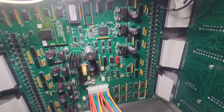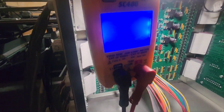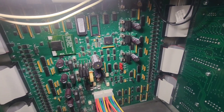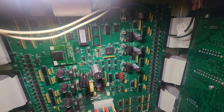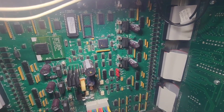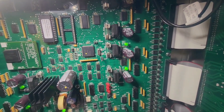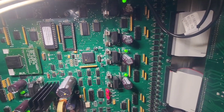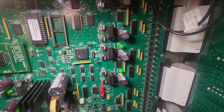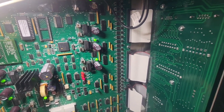All right, let's turn some power on here. GSX with Next-Gen — F2 fuse is blown, I've metered it, verified the fuse is in fact not good. But we can go ahead and power it up — you can see the LED didn't come on. So F2 fuse is going to control the four, five, six pin holders and the spotting tong solenoid.